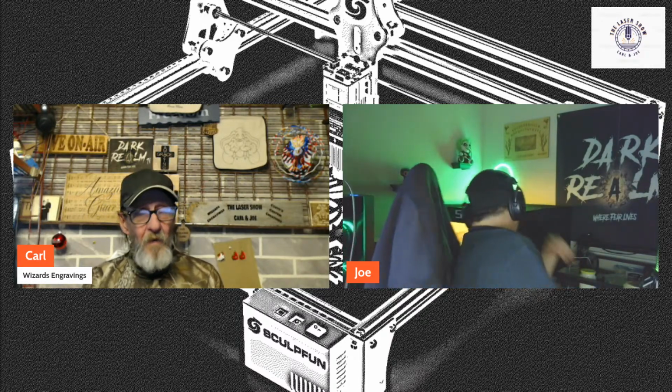Right before he got ready to go, I remembered something he told me at the very beginning. The last thing I did was use a rotary tool. I looked on his LightBurn, and there in the corner, it had the little light on the rotary. I said, you forgot to turn that off. He clicks it off, and it did the 4-inch square like it was supposed to. So always remember that. If you use a rotary tool with your laser and you disconnect it, make sure you shut the rotary function off. It won't do it automatically. I was trying to do a 4x4 square, and it was doing 4x6. So it definitely will not do it automatically.